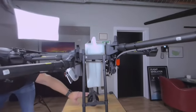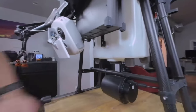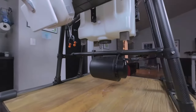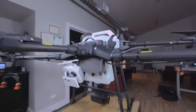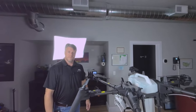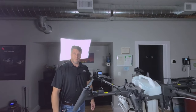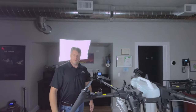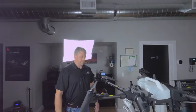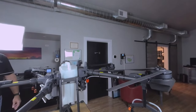If David pans down here, this is the obstacle avoidance radar. This thing's going to spin at about 15 revolutions per second. That's what allows you to do obstacle avoidance, but it's also doing terrain following. So if your crop is on a hillside, the drone is going to sense that the ground is higher and follow the terrain — where without that radar it could potentially run right into the side of a hill. So it works for stabilization, obstacle avoidance, and terrain awareness as well.